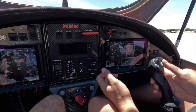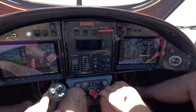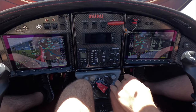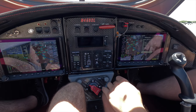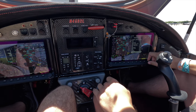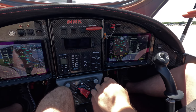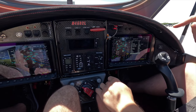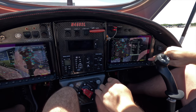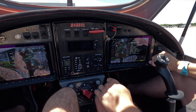Controls check — you do it yourself. And on the nose wheel steering, I usually do the rudder check when I'm rolling, because I don't want to burn rubber off the front tire. Canopy check: normally now we would close it, but I don't think that's a great idea in Florida. We have one more canopy check just before takeoff. So that's the before-starting engine checklist complete.